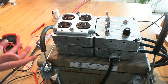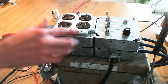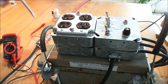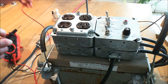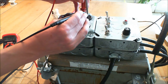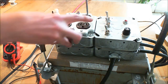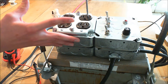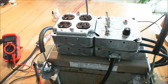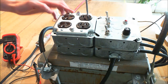So how is this making it safer? The point is that the outputs here are not in any way connected to the mains input. I have a screwdriver and I'm just mucking around with the controls — and it's in the hole. We can test that it has that potential by putting one probe on the neutral and the other on the screwdriver. See the 122? Dangerous stuff. But I'm going to have my hand touching this earth-connected box — which sounds like a really bad idea — and nothing. I can hold on to that all day. This is the essence of an isolation transformer.